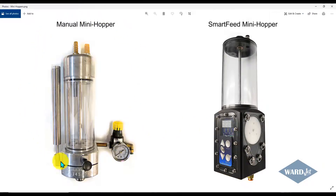So if you have the manual mini hopper, we can put an M00 code into the program. At the beginning of the program, we'll put M00 to stop the machine to give the operator the chance to make sure that this is at the low pressure setting for the marking. And then again, when the pump switches up into high pressure, there'll be another M00 which will stop the machine again with a message, signaling the operator that he needs to slide this back up to its normal high pressure setting.